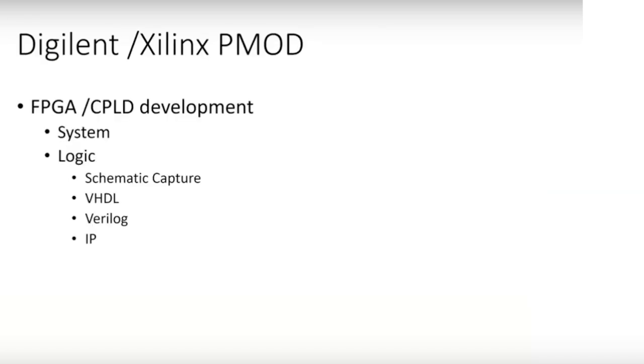I've developed a number of things on field programmable gate arrays, FPGAs. Now, an FPGA is a big old chip, about the size of one of these better microcontrollers, except none of the wiring on it is complete. You give the wiring to it in a serial EEPROM, and when you switch it on, it loads its own wiring and becomes whatever circuit you want it to be.